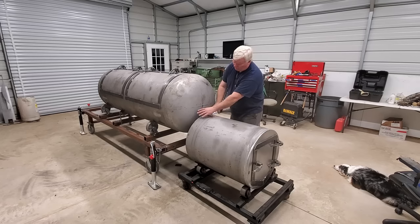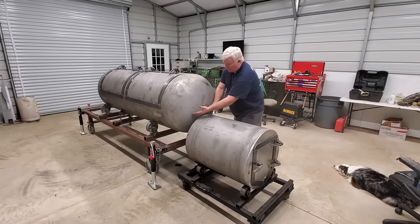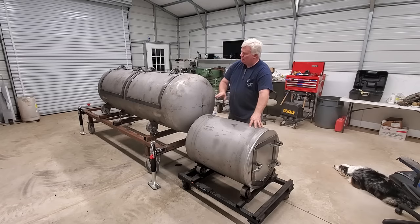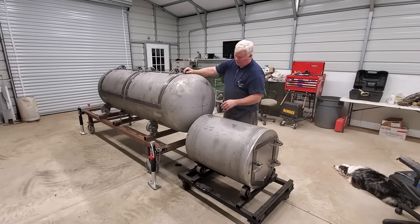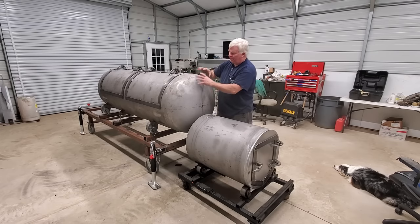without doing two things. One, you'll decrease the size of your throat. We don't want that. We want our air to flow as nicely as it can, so we want as big a throat, in my opinion, as we can get. And we don't want this sitting so far down that it's likely to drag and cause ground clearance problems. But we don't want it so high that we have a significant hot spot right there. I have found through trial and error that about 2.5 to 3 inches down from grate level is kind of a sweet spot. It's a compromise between ground clearance and this hot spot being so focused on that grate,